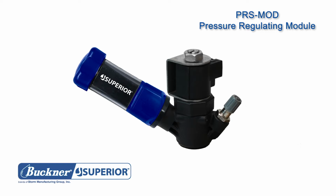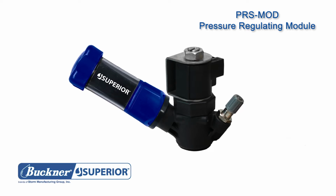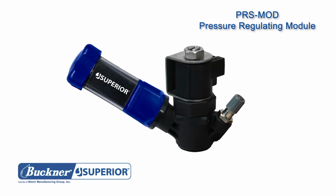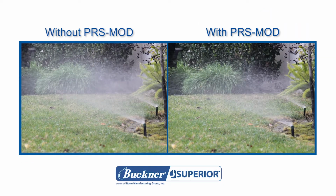The Buckner Superior PRS-MOD is perfect for adding pressure regulating capability to new valve installations and for retrofitting existing irrigation systems. PRS-MOD regulates outlet pressure at the valve, regardless of incoming pressure fluctuation. The PRS-MOD allows for regulating pressure to the optimum level for the spray or rotor.